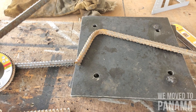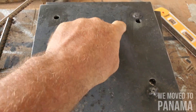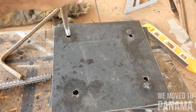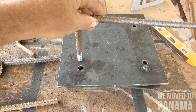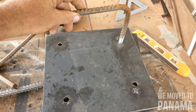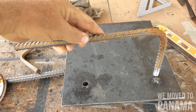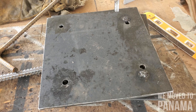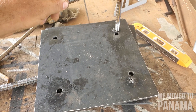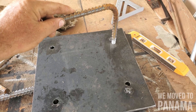That's where my square tubing will sit in the middle, welded into the square. You'll have two bars going this way — one there and another one here going in that direction — the point pointing to the right, and the other pointing to the left on the inner one. So the two bars oppose each other. I made a mistake earlier drilling four holes in a square, so I had to cut a piece of bar, put it in, weld both sides, then cut it off to close that area and make it stronger.